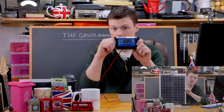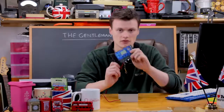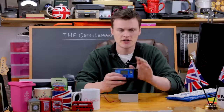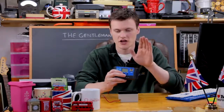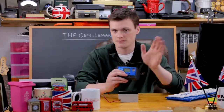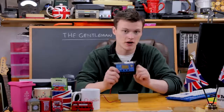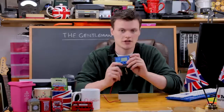To power this project I'm going to be using a solar panel, which comes with a solar charger. The reason I really want to use this is because it comes with a USB port, which means I can directly power the Raspberry Pi without needing any kind of power converter. Now this can cause a few issues, especially if it uses a linear regulator like a 7805, because that thing is going to just waste power — you'll get less than an hour probably using it to power the Pi. But if it actually uses a DC-DC converter, then I'm in luck.